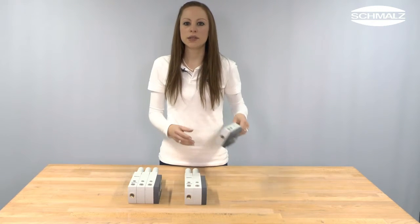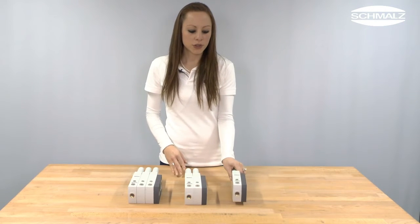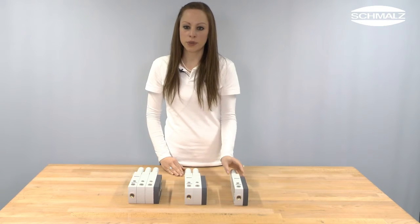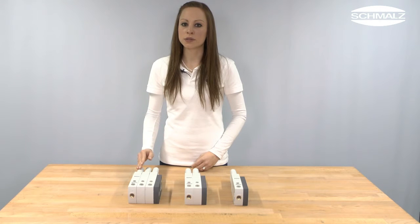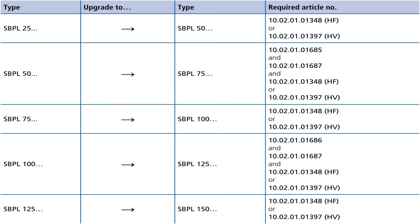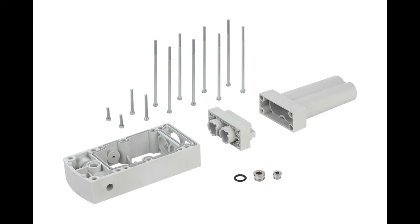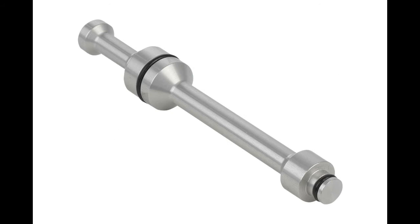One main body with one eco pump and one blind plug, or two eco pumps, is required for performance level 25 or 50. The ejector can be upgraded with up to two more housings with one or two eco nozzles each. Extension kits with fitting screws and a suitable vacuum connection are available as accessories. The corresponding eco pumps and blind plugs can be ordered flexibly in addition.